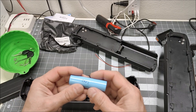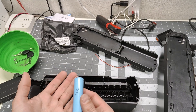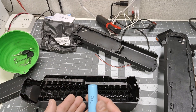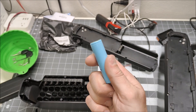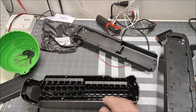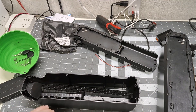I stored these cells fully charged a year ago. So I'll be able to voltage-test all the cells and find 52 cells that are still above 4 volts, which means they're not self-discharging. If they're still above 4 volts after over a year of storage, that means they're good healthy cells. We'll use those for this build, making a battery that should not self-discharge during long periods of storage. So that's the plan — next we'll find the cells and go from there.